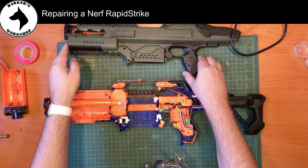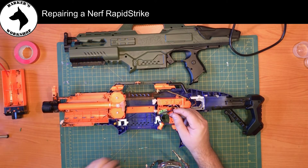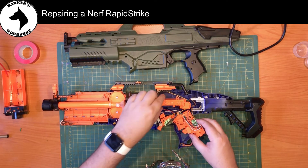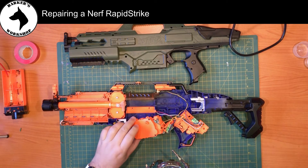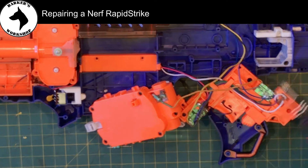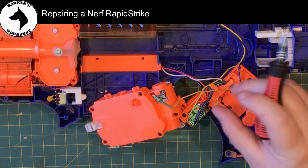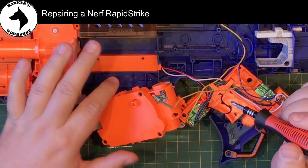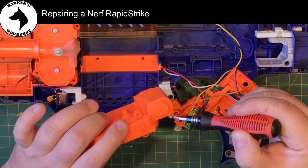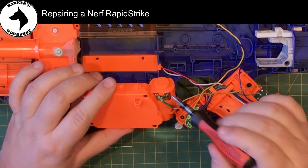As you can see in the top-down view here, I've already opened the blaster up. I've got the wire I need to work on and the resistor right here that needs to be fitted. Looking at the cap — this cap is broken off — but right on the edge of this resistor I can see a color band that looks like silver. This resistor has a color combination that gives us its resistance value.